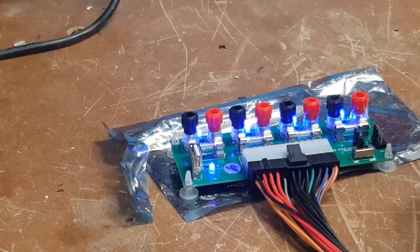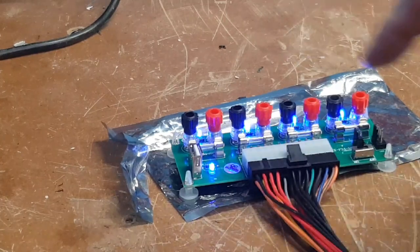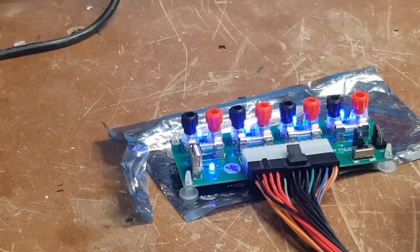The only problem with using these as a power supply, you'll have a lot of ripple on the earth line, and maybe even on the DC lines because of the switch mode effect. The only way to get rid of it is to put a decent capacitor between earth and the power line, a couple of them, to filter it out, but it starts getting costly anyway. But nowadays capacitors are pretty cheap.